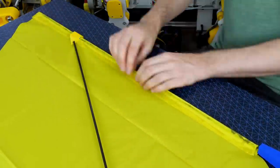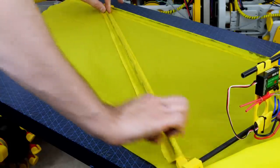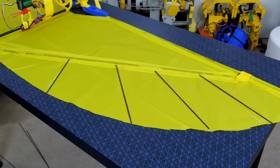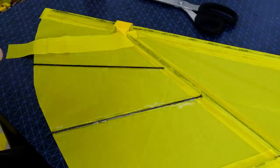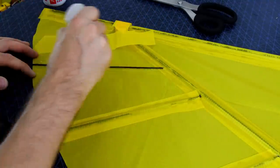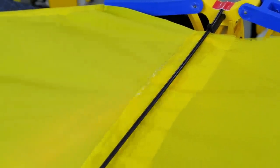I've tried to squash the glue along to make sure it's stuck to the carbon fibre rod as well as to itself. For the cross brace tube I've done the same thing and then used a spare piece of fabric cut into a strip, stuck down so it adheres to the carbon fibre and to the main wing fabric - it should be pretty strong once the glue is set properly. I've also laid out finger spline sections made of 2mm carbon fibre rod which is pretty flexible but helps hold the edge of the wing tensioned so it always trails the rest of the wing and pushes air backwards during the flapping motion. I also added two thinner carbon fibre rods above the wing, zip tied on each end onto the main tube, to stop the wing lifting up in the middle so it'll always fold correctly.